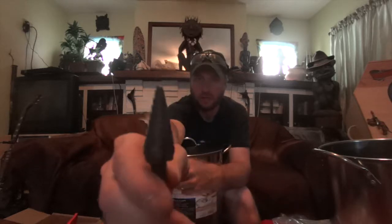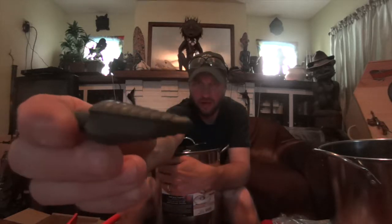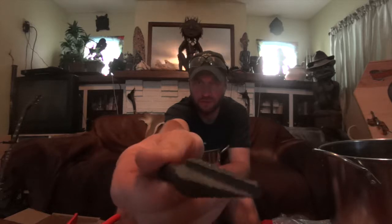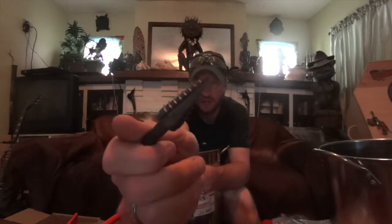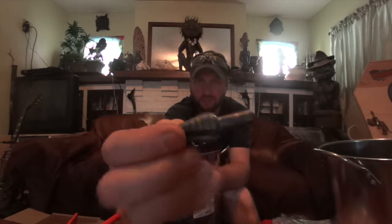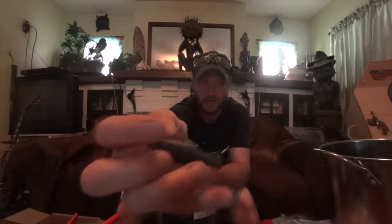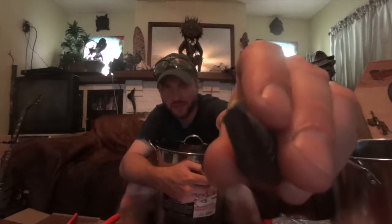For that, I recommend a step bit. If you're not familiar with step bits, add one to your kit. One bit, especially through metal, is phenomenal. Bits are at Home Depot, Lowe's, wherever. Get a step bit. Sizes are marked on the package, from whatever you buy it at to the largest hole that it will drill. Step bit is phenomenal in that a lot of times with the point, you don't even need to do a starter hole, even in metal.